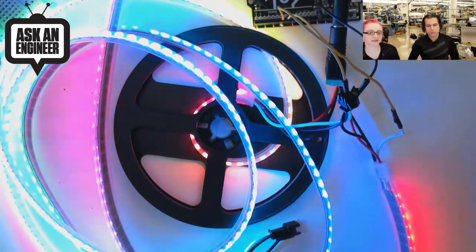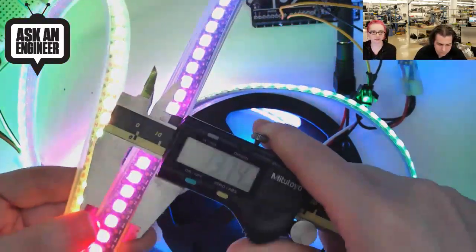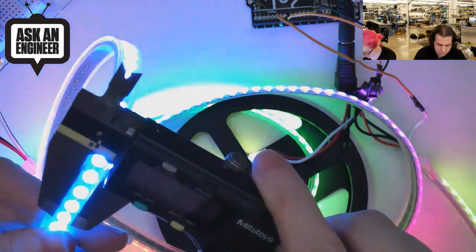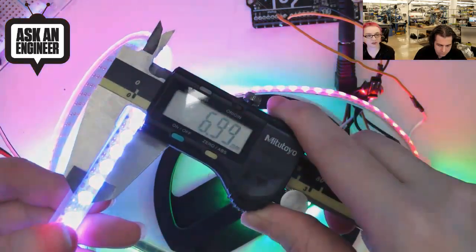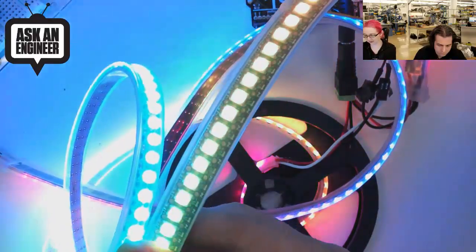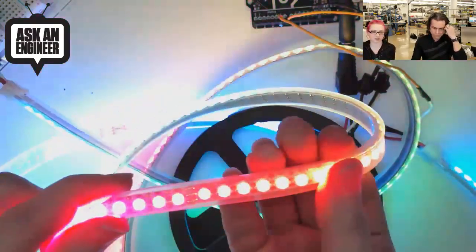We've got a new overhead — a new fancy overhead that doesn't crash. The old NeoPixel strip measures about 13.75 millimeters inside the sheathing, and this new one is about 10 millimeters. The strip itself on the inside is about 6.7 to 7 millimeters wide, while the wider strip is about 12 millimeters. So it's about 5 millimeters thinner, but it still has the same pixel density — it actually is 144 LEDs per meter. And there are large cut marks in between, so it's very easy to cut and organize.